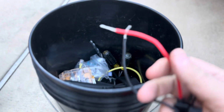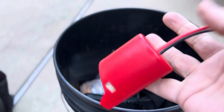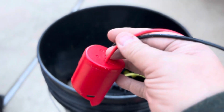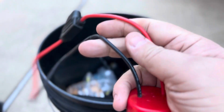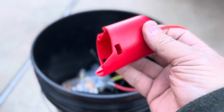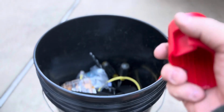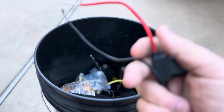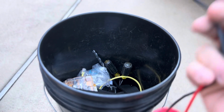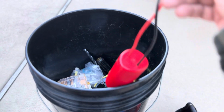It just clips on to the 12 volt battery. And then it's just got 2 leads on it. I ordered some alligator clips, so I'm gonna put alligator clips in that. But if you need a real quick 12 volt power supply, this is great. In fact, yesterday we did a house, they've got electric door strikes, and we did 4 doors. And so when the carpenter was putting in the door strikes, it was real easy for us to test this without having to run back to the rack closet to give it power. I was able to just plug in my battery, touch the 2 leads, and you could hear the relay trip, and we knew that our wiring was good to the door. So not always, we don't use it all the time, but when you do need a quick 12 volt power supply, this thing is amazing.